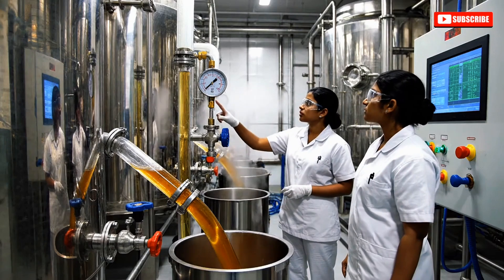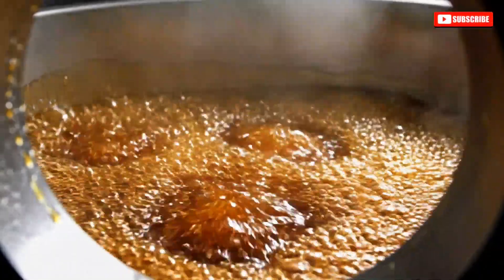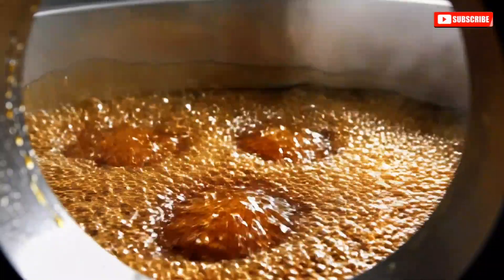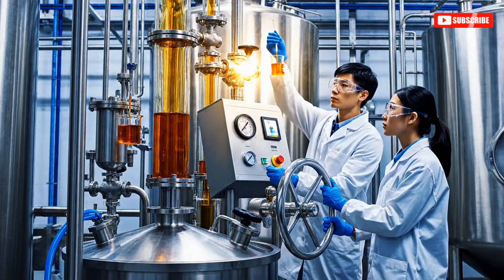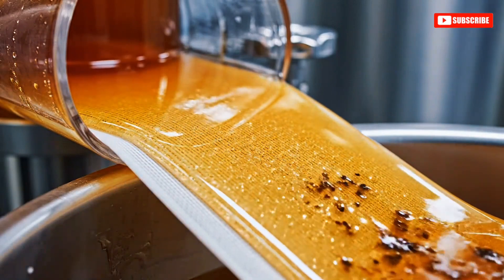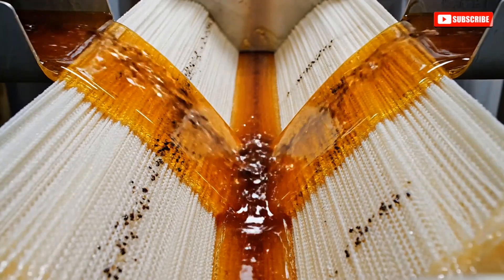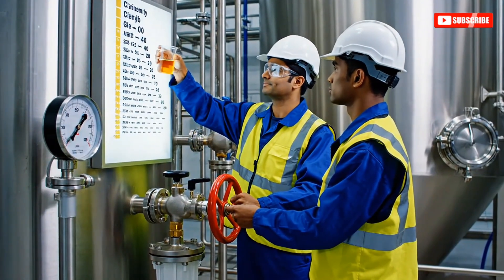The vacuum pressure is stable at 60 kilopascals. Good. The brix level should be increasing nicely now. To ensure the highest quality, the concentrated syrup is carefully filtered. Workers meticulously check. The clarity is perfect on this run. Good. Adjusting the flow rate up now.